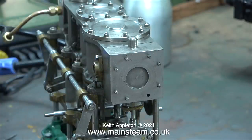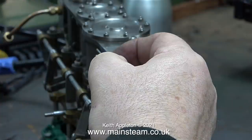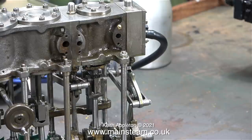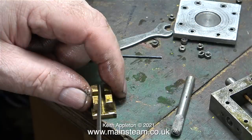The fits on this engine are quite good - you can clearly see the studs are a very snug fit in the holes, apart from the one that's missing. I'm pretty sure this is a sheared-off stud in the cylinder block, and from my past experience these studs are quite hard and either impossible or very difficult to drill out. Drilling out the remains of the bolt that held the exhaust in place was very easy as it was quite soft, but I think getting rid of this broken stud is going to be much more difficult.